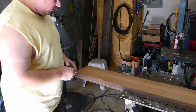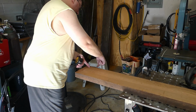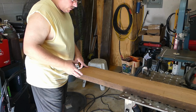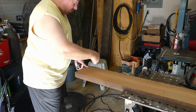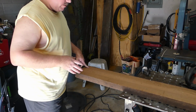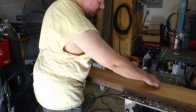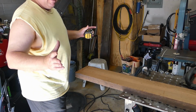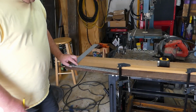So we're gonna have a 2 inch thick shelf, and eventually what I'm going to do is cut off about an inch on the back here. I'm just gonna run it through the table saw, we'll get that picture going. And I'll drive some dowels in here. We'll drill 3 holes for a 1 inch dowel to come through, and we'll glue it into the back post, and then we'll mount this back brace onto the wall, slide the front of this on, make sure it's all nice and smooth, and walk away happy.